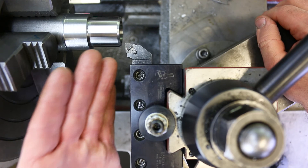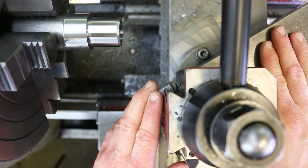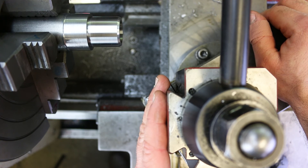I'm going to go ahead and remove that tool and the indicator. For the rest of this project I'm actually going to leave the compound at 30 degrees, because we're going to have to do another identical chamfer on the back side of the part. So why not leave it in this orientation now that it's already there.